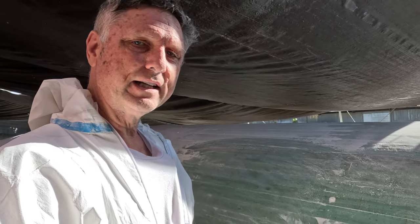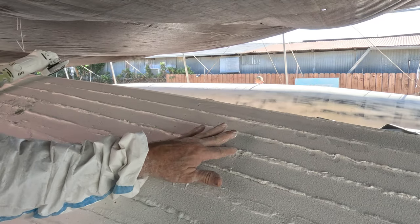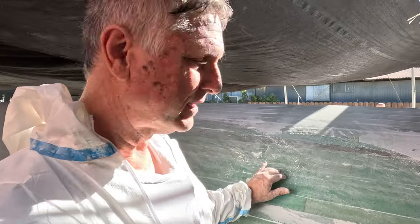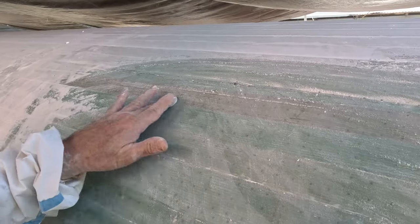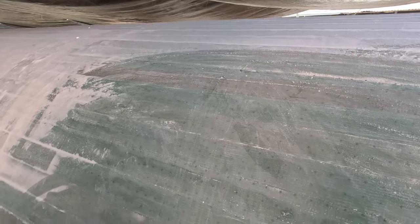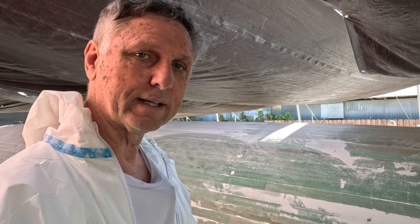The verdict on leaving the squeeze-out: where we left too much at the beginning, up here for example, we should have taken some more of this down but still left some. Later we got wiser about that and left some but not quite as much, so it takes a little less sanding. Regardless, either approach is achieving the goal we want — these seams here are much cleaner than they were the first time. It's going to take a lot less work now to get this right; a lot less putting epoxy on and sanding. Hopefully we'll get that in maybe a couple of rounds.